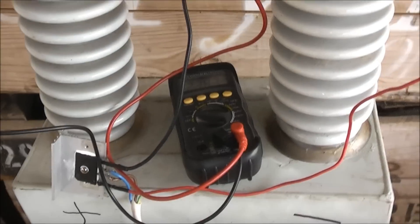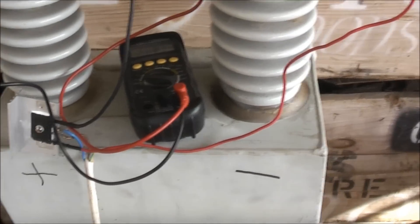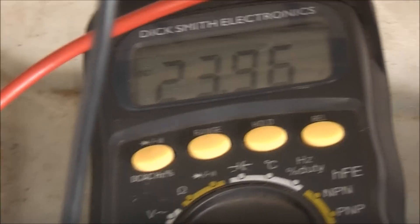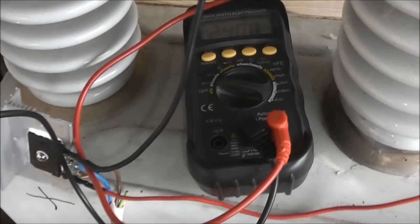I might have to make a capacitor reformer, just to reform this a little bit, to try and keep it in good spirits, because this is actually self-healing dielectric — the oil inside this. At that rate, it should be 2,999 before it charges up to full potential. The light bulb is limiting the current too much, in other words — they need a bigger ballast. I need some more current in there, so I've put a 10 amp column heater on instead of this light bulb, to see what happens.